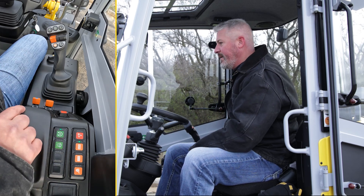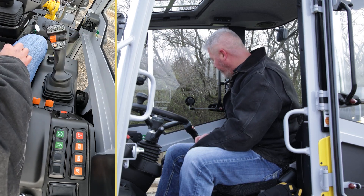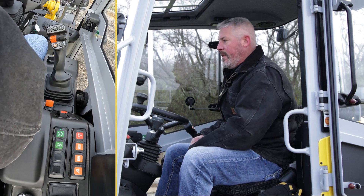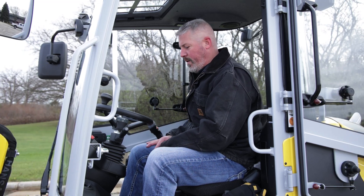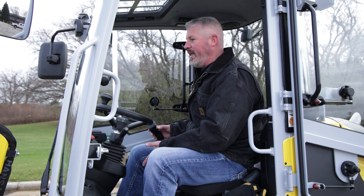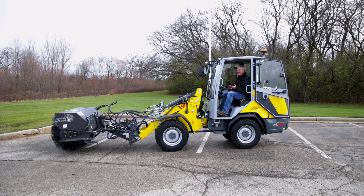When you've got the flashing button, it's waiting for your command. Select the direction of flow, then pull the trigger on the front side of the joystick — the system is idle and waiting — and on another joystick pull you've got continuous flow. Now you need to give the attachment some oil flow. In auto mode, if you want to run more oil to the attachment, you increase engine RPMs with your right foot pedal and modulate travel speed using your inch braking pedals.